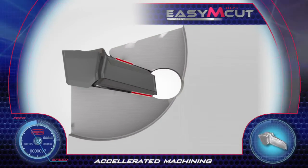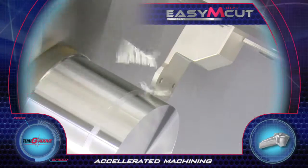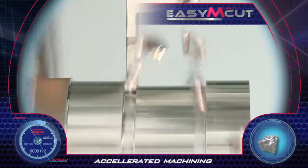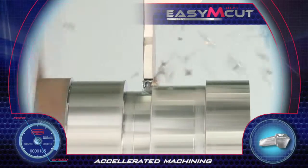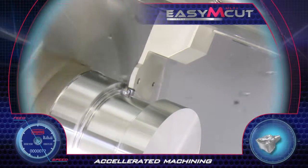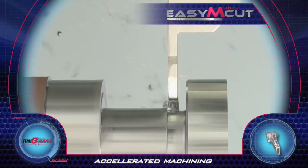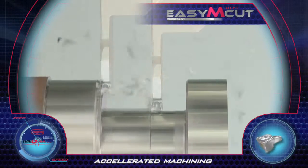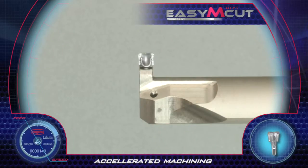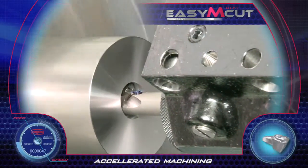The insert is clamped rigidly and is seated on a bottom prism to resist side cutting forces. This unique insert geometry enables grooving and side turning in both directions with excellent chip evacuation and superior surface finish. The same insert can also be clamped on a boring bar tool holder for internal grooving and turning operations.